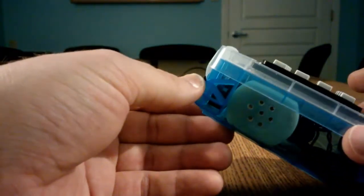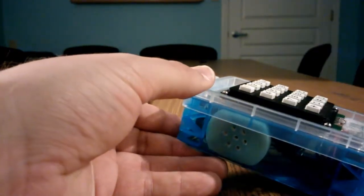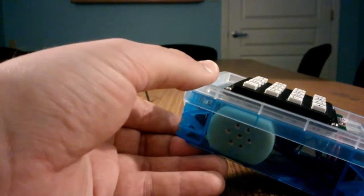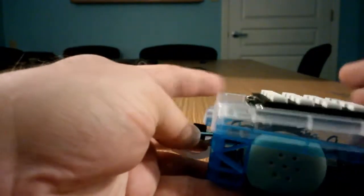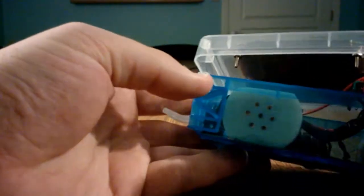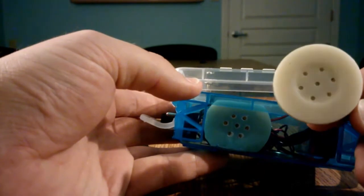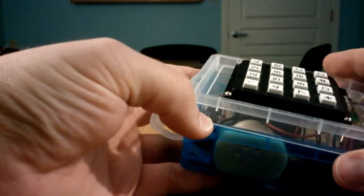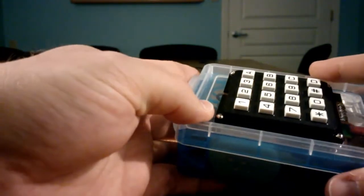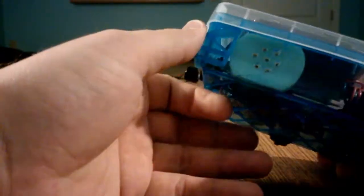This is an SD150 speaker, just like the external one that I use in all my videos, that I pulled out of an old phone from a thrift store. I had to use the Dremel tool and cut down the sides of it, which you can see, just to get it to properly fit in the case. It's usually a circle. Here's one that's still intact. I was able to saw down the sides without actually getting into the speaker element at all, which is pretty awesome. So it fits perfectly in there, and I just used some hot glue to hold it into place.